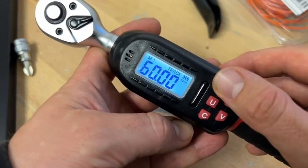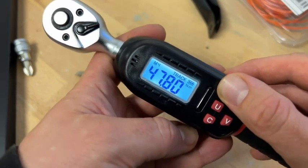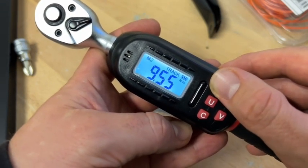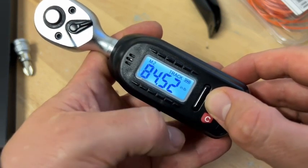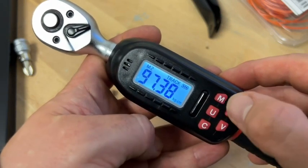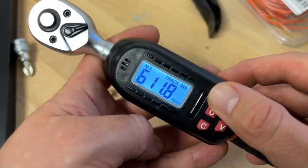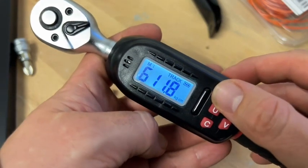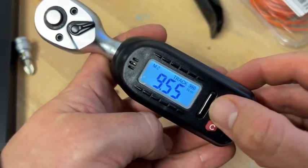It is also highly suitable for easy reading and use. The torque wrench indicates values at plus or minus 2 percent clockwise and plus or minus 3 percent counterclockwise. You can tighten screws or bolts in a clockwise direction and measure it, and of course counterclockwise too. This device conforms to the international standard DIN ISO 6789.